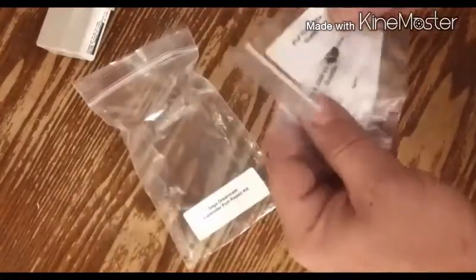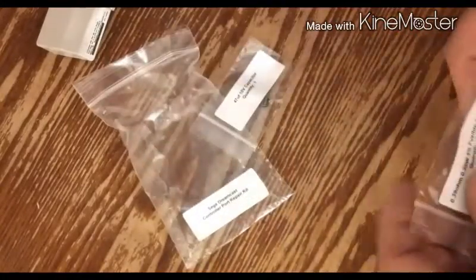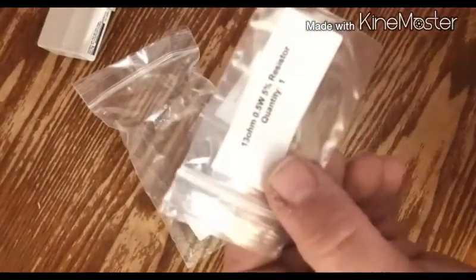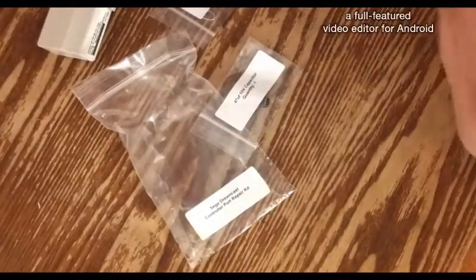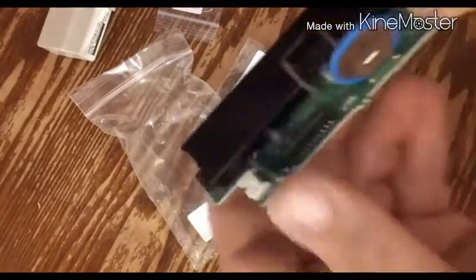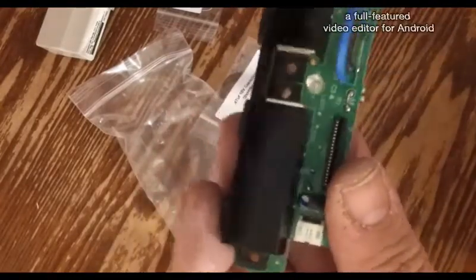So, what do we need for that? Well, you can get one of these on eBay. It's just a standard kit. It comes with a 47 uF 10 volt cap. That's that thing there. Here's your fusible resistor. That's what's missing. And here we have another resistor. It's just a simple 13 ohm. Okay? And I believe the 13 ohm is already in there. It looks like we might only have to work on this right here. So let me get to soldering these parts out, and then we'll go from there.